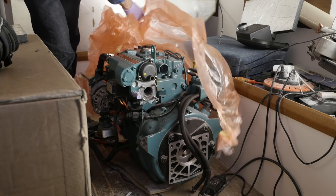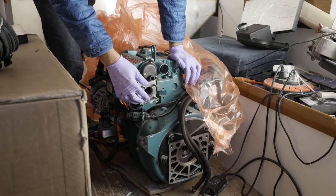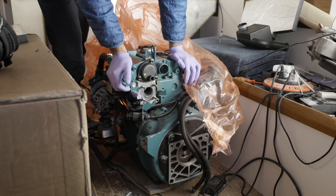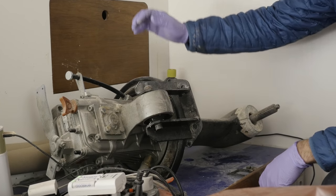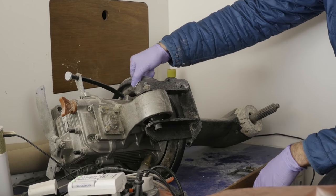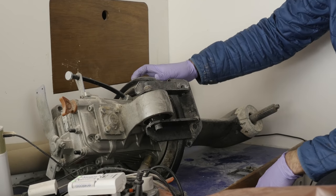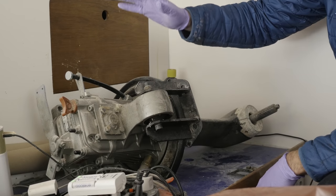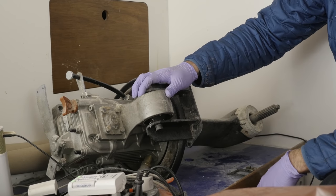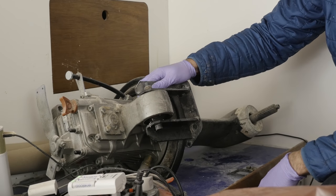Turning our attention to the green monster, the exhaust elbow is of course located right here. I won't have that for about a month, but there's still plenty of other fun to be had. This weekend I hope to replace the diaphragm on the sail drive — that's this rubbery bit here that keeps water out of the boat — and also get the sail drive mounted in the engine compartment and get the engine moved in there. But that's a pretty tall order.